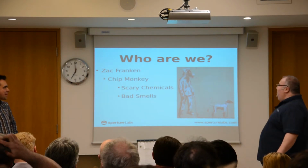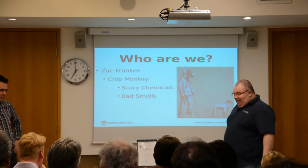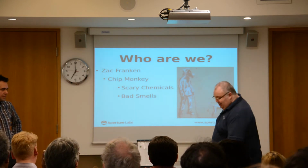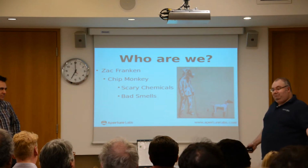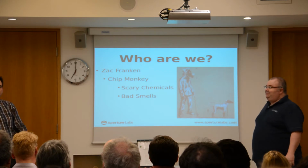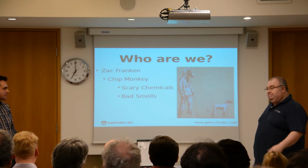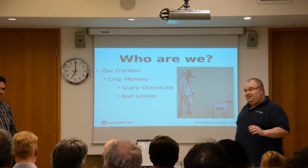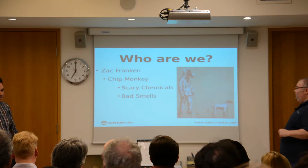So I'm Zach Franken. I tend to handle the hardware, which day job means doing things like etching chips down to the silicon and ripping apart any sort of hardware that claims to be secure. If you try and implement stuff the way we were just talking about, then we'll drill into your chip without even talking. And it's amazing that happens quite a lot. So we were talking about PIC chips earlier. You can send a low-end PIC chip off to China, and you can get the code back for about £90. It's that easy. More modern PIC chips, price goes up, but they'll still send you the code. So it all depends how much you want it.